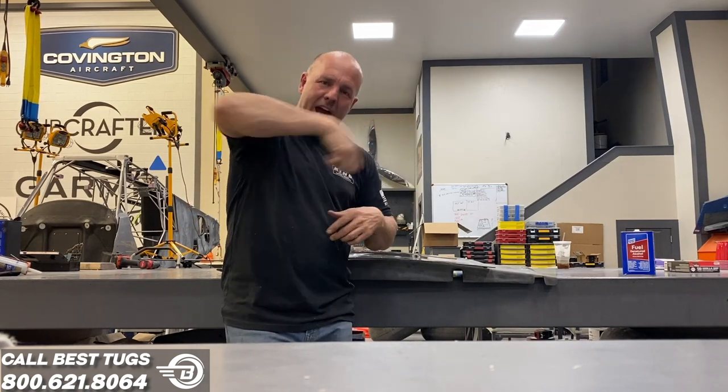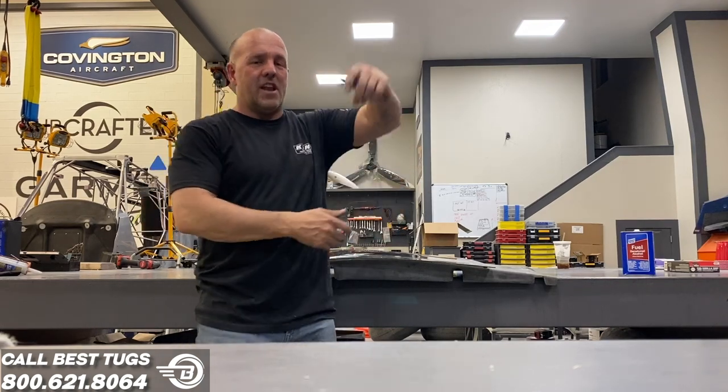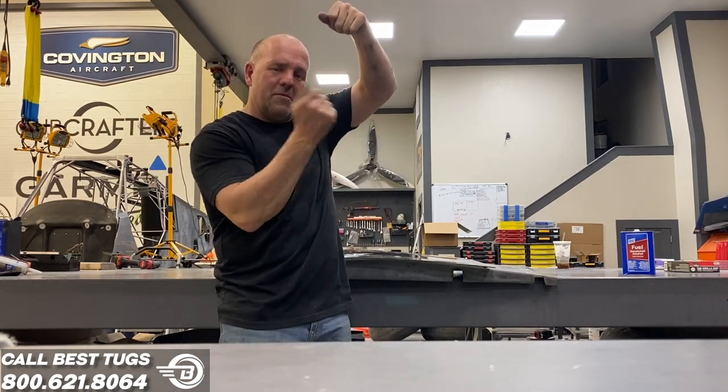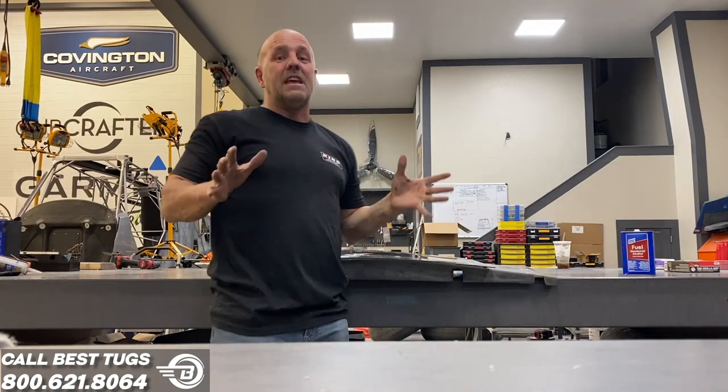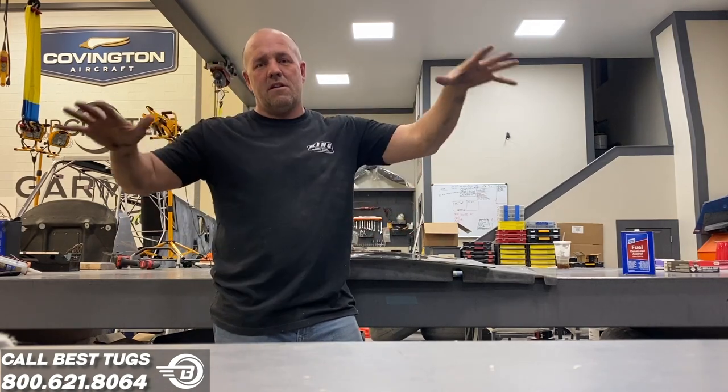I let that warm up for about 45 minutes, got it nice and hot and it still wasn't moving. And then I got the heat gun and I went back and forth multiple times, and then occasionally lifted it up, warmed the underside, set it back down, went back to the top. You need to get really even heat. That's the most important part. If you don't, when it cools off, it's gonna get all wavy on you. And the thing to keep in mind is, as you heat it, it expands. And so when it expands on one side, it starts to curve in a way that doesn't look natural, and when you get it hot enough, then it will fall.